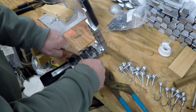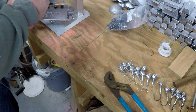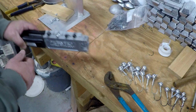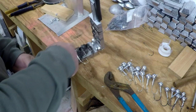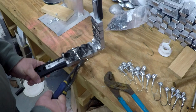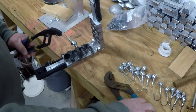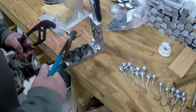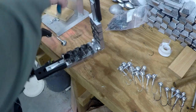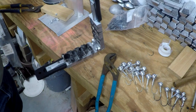You might have noticed that the inside of this mold is pretty black — there's a reason for that. It's called sooting. You actually take a lit candle and hold it right up against the aluminum, or cast iron if you have a cast iron mold, and it'll create that soot. What that does is it's almost like a flux — it makes sure that the lead doesn't solder itself right to your mold. I definitely recommend sooting a new mold to get you started. Once you do it once you'll probably never have to do it again, but it really helps those jigs release a whole lot easier.